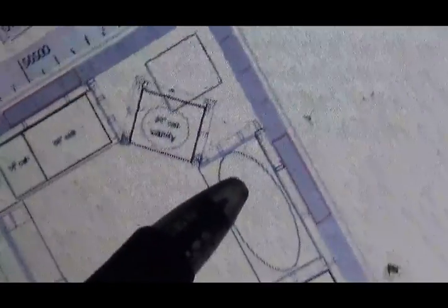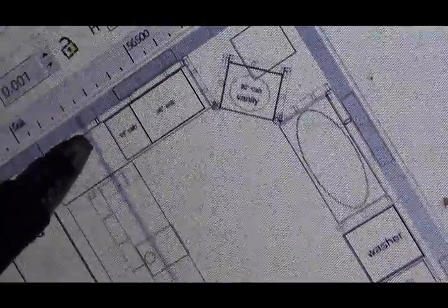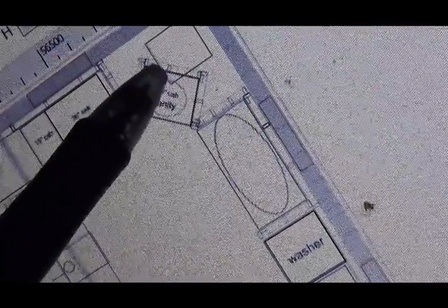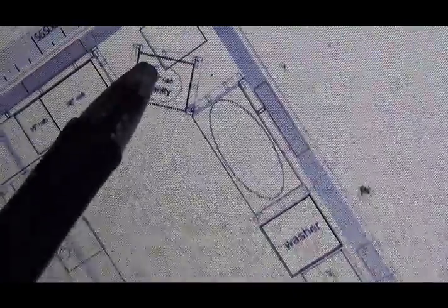Tub. Right now what I'm looking at is a concrete counter, and this being extra wide. Your standard counter is like 26 inches, your standard base cabinet is like 24. You may get a small vanity that's like 18. These are typically 24 wide, 24 deep, 36 tall. But you also sometimes get vanities that are 18 inches deep and like 30 inches tall — these little baby vanities, which I don't really get.